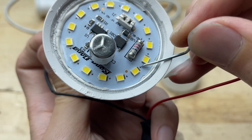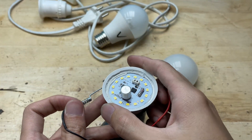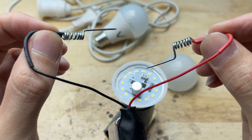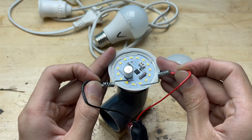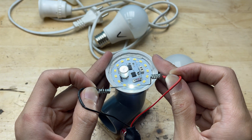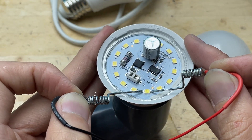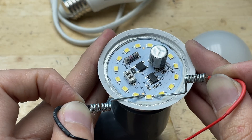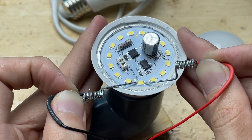It's important to note that the red probe should always touch the positive anode side of the LED chip. With everything set up, I carefully started testing each LED chip. I touched the sharpened probes to the contacts of the first chip, and success — it lit up immediately, showing it was still good. Moving along the ring, I tested each one in turn, noting which ones responded and which stayed dark. Whenever a chip didn't light, I marked it as faulty. This method made it easy to identify exactly which LEDs needed replacing. Step by step, I could map out the entire array, separating the healthy chips from the dead ones before moving on to the actual repair.